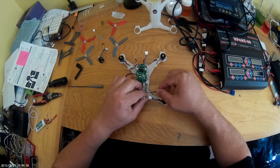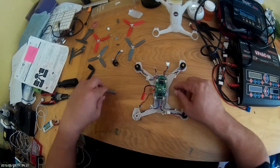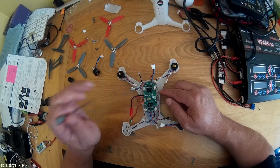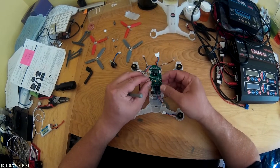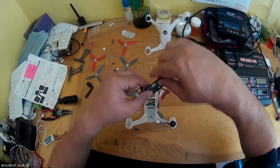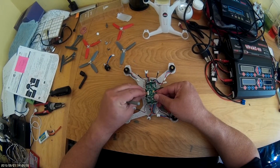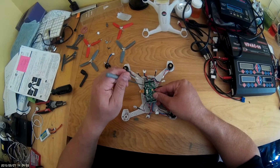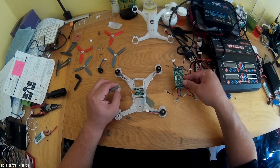They just plug in, and then you've got your LEDs that sit right here in the arms. There are four screws — they're teeny tiny screws — they go here, here, here, and here. You take those out, and there is a ribbon cable that connects right in there, along with a black rubber piece that holds the two together. So you take that out, take the four screws out, and then that separates — so your ESC is now separated.